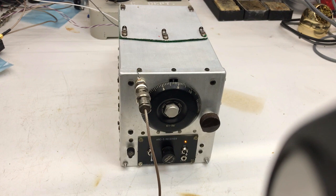So just to give you a quick demo on this restored receiver: all the capacitors have been replaced. There's a DC-to-DC inverter on the back that basically provides B-plus in substitution of the noisy dynamotor. The filaments have been rewired to work on 12 volts, so as you see, this radio works on a standard 12-volt power supply and draws about two amps.